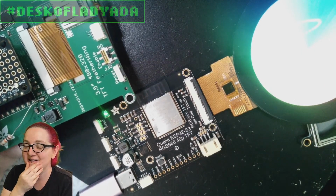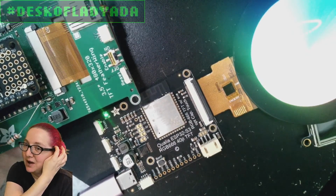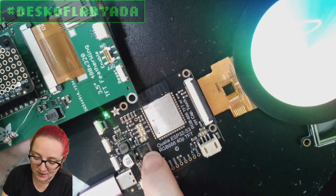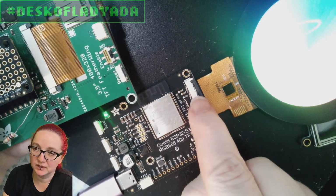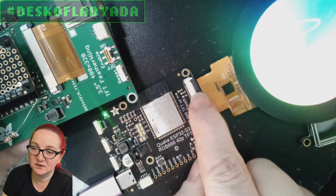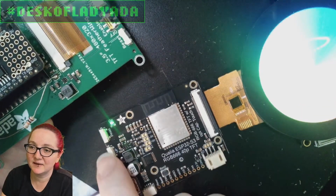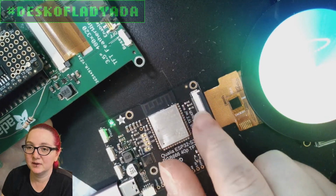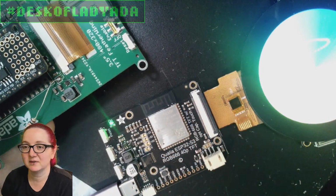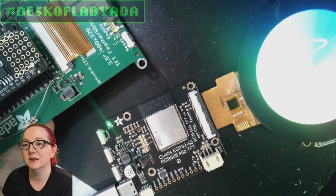And annoyingly, I think I still need to have the IO expander, even though I'm not using it for controlling the SPI pins to do the init code stuff, because I still need these buttons. I need the IO expander for the buttons and for the TFT reset and the TFT backlight, because there's so few pins available, and I want to keep all these GPIO down here.